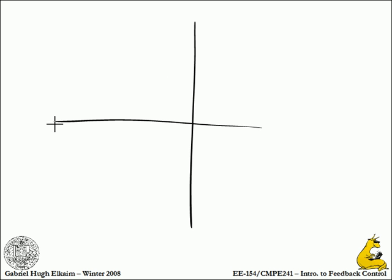It's got some unmodeled, or in this case, modeled high-frequency oscillatory modes. Okay, and normally the root locus on this is, well, that goes up, that goes down, that doesn't help. Okay, and I decide that I'm okay with the speed of the system. It's fast enough, but it doesn't give me the damping I want.